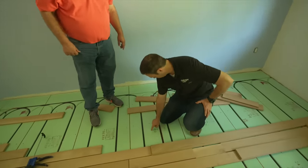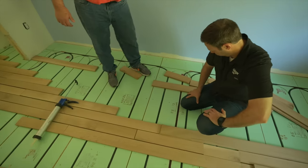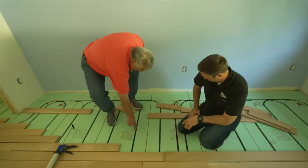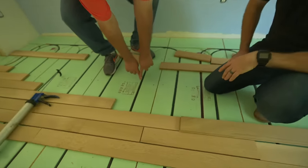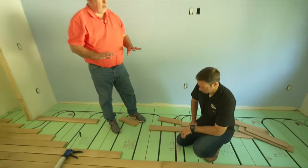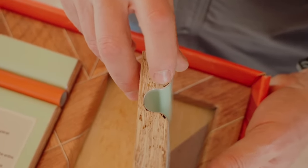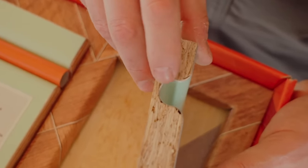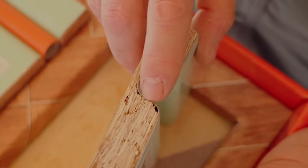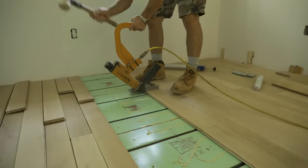This green facer is a full aluminum facer. It goes down into each of the grooves. What it basically does is — we get a bunch of heat from the tubing, but aluminum has the ability to spread that heat quickly, evenly, and really well. So you have essentially a floor of aluminum that is spreading the heat, and then the hardwood floor touches that aluminum, warming the floors, which is then warming your feet.